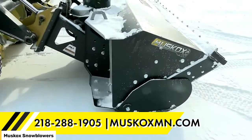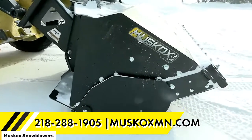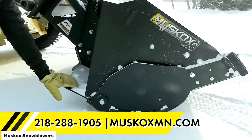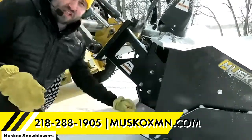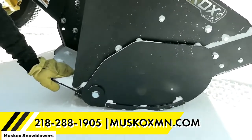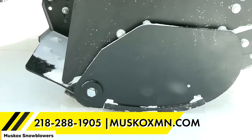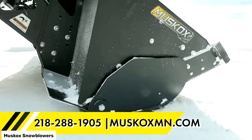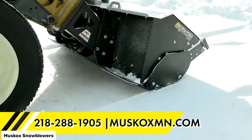Now Ron's rotating the machine, and now we're getting onto our steel cutting edge. So this is important to watch. Before, when we were looking at this, you could stop Ron there for a second. This glide plate was on the ground before. Now it's rotated up in the air. I'd say that's about 4 to 6 inches. It's rotated in the air. And now we're riding on a steel cutting edge. So if we wanted to break up any ice, shear any type of ice, we're in that position. So we'll watch Ron go forward for a few feet. You guys can see what that looks like as it's pushing forward. Now you can see he's pressing more down on that snow than he was before. And this is allowing us to scrape any type of ice that we have on the hard surface.